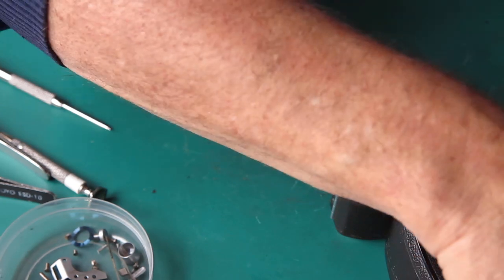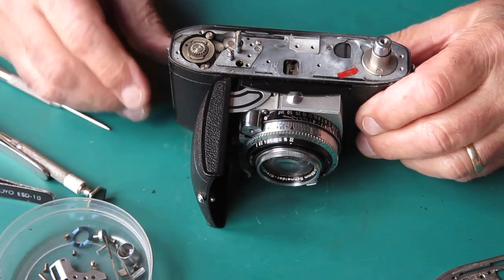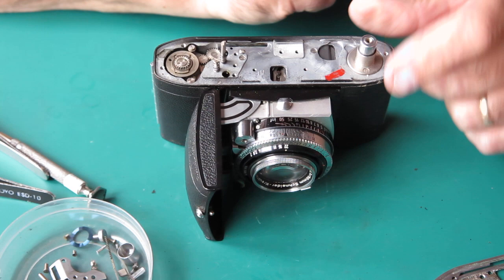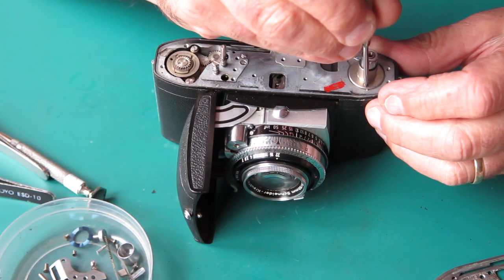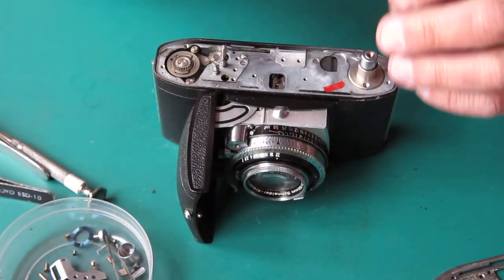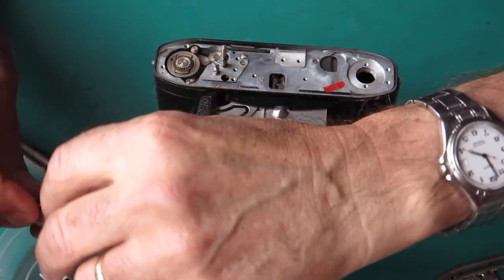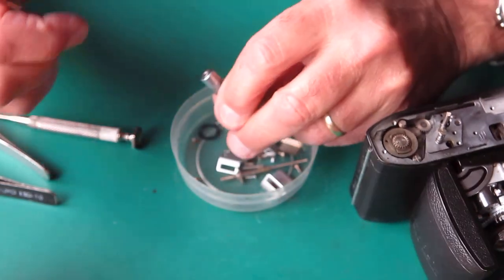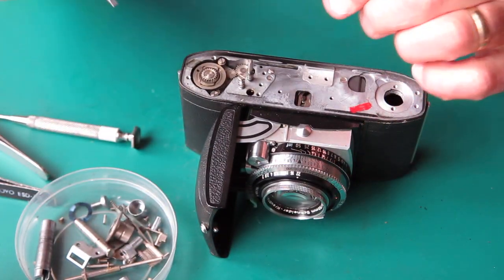It's not at all uncommon to find the rangefinders in a fairly terrible state. There's about 20 air glass surfaces involved in the range viewfinder and rangefinder system on a Retina IIIc, and with that number of surfaces they can all gather up a little bit of haze, and between them you end up with a very dirty, cloudy looking viewfinder. Now the viewfinders in the Retina IIIcs are supposed to be yellow. That's not a bug, it's a feature.